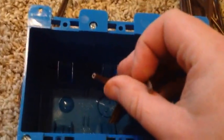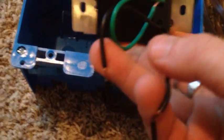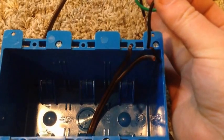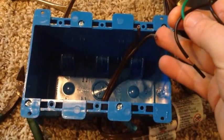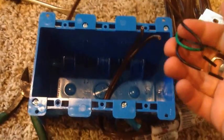This is the electrical wire coming into the box — this is the plug end. This end is where you plug in, and these are the wires coming through. These are the dimmer switches, and you'll notice each one has two wires on it. One of those wires is going to connect to the plug side, and the other is going to go out to the motor. I'll include a step-by-step reference in the video.